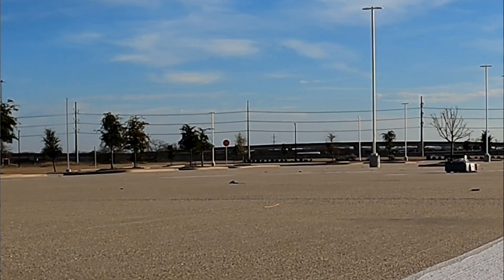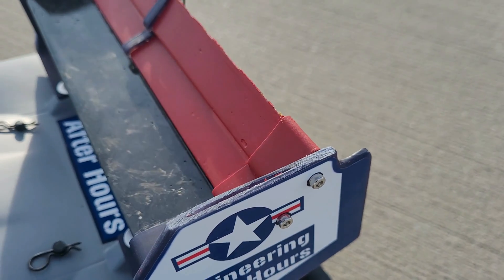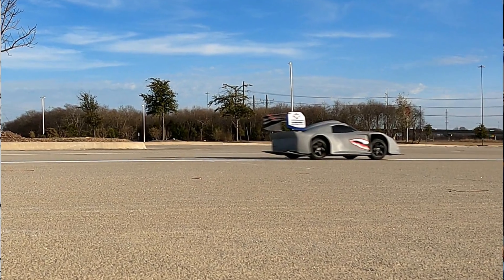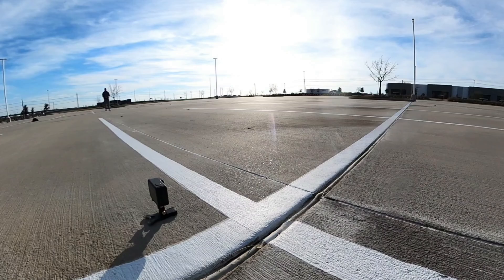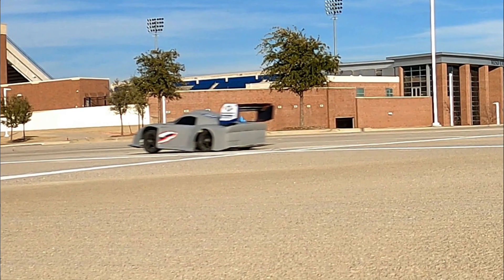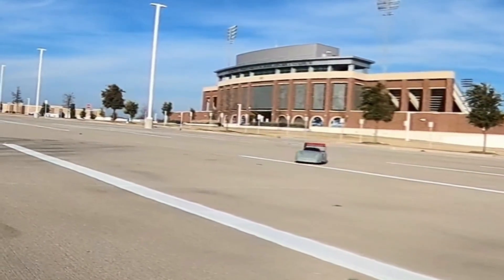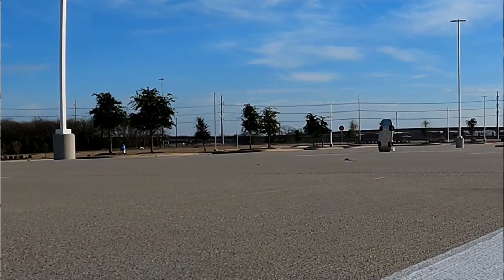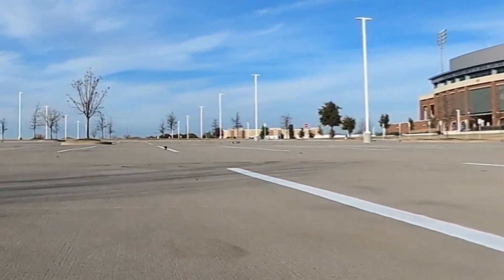When I tested with the DRS open at higher speeds, the system actually worked beautifully — I know this because it didn't squat anymore, the car stayed pretty level, and I didn't get this obnoxious flipping symptom. So at least our DRS does what DRS is supposed to do. But there's way too much rear downforce with the DRS closed. Eventually I sent this car into a cartwheel, which is probably the absolute worst type of crash, and I demolished the rear wing completely.